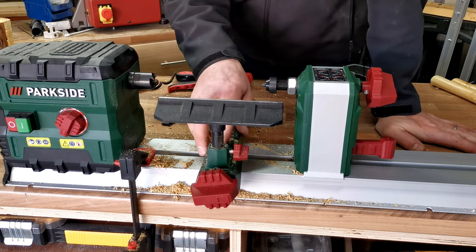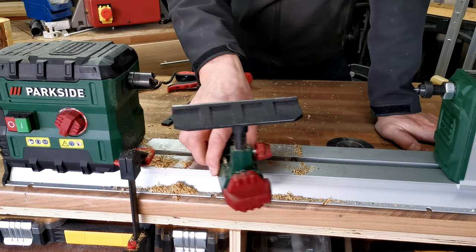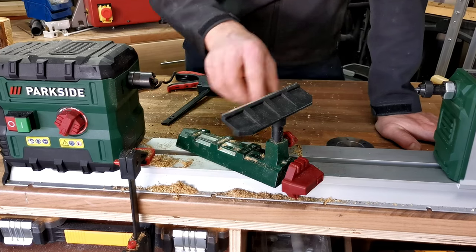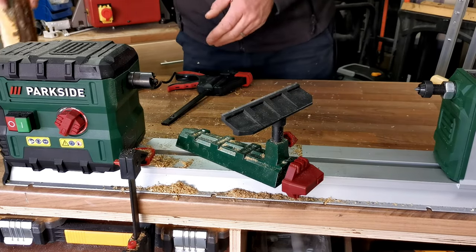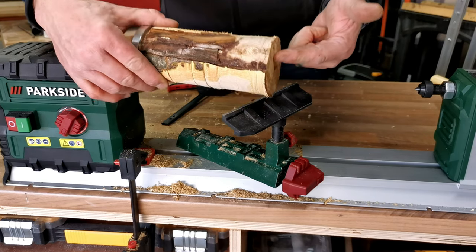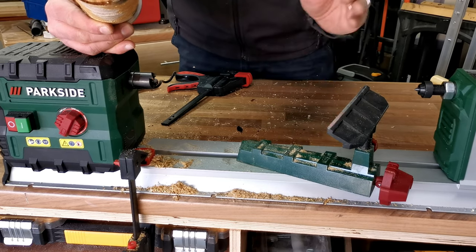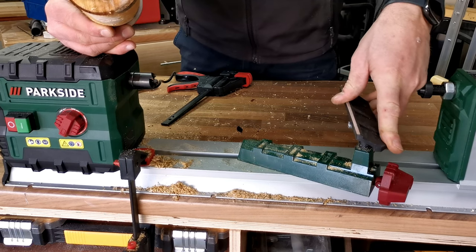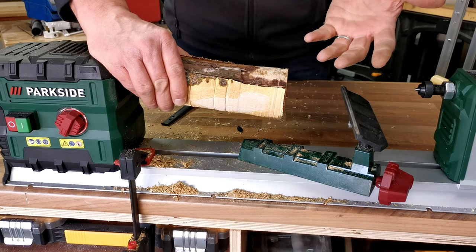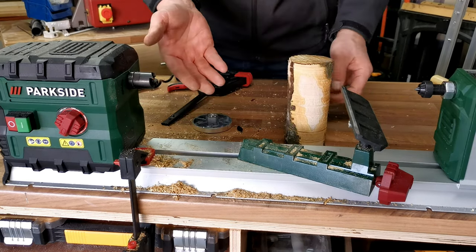As you can see there's still quite a bit of bark on it, but I have managed to make some grooves in it and I've got a lot of the bark off, which I'm really pleased about. Again, I think a lot of this is just down to my inexperience and I'm going to watch a lot more YouTube videos before I use it properly, but it was definitely better. The power did cut out quite a bit when I was going at it. The other way to use this is to loosen this off so it pivots round. You take the plastic bit off the end and when this bit is in the end of the piece of wood, you can hollow the inside out by putting the tool guide at the end like that — useful if you're making a bowl or something like that.